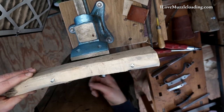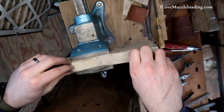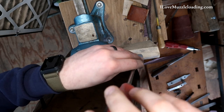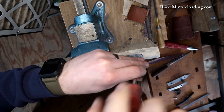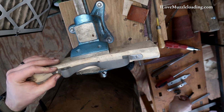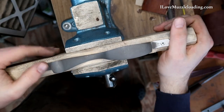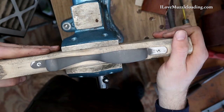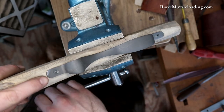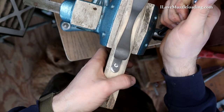I'm just chucking this up in the vise. We're going to attach our trigger guard to it, and that's going to make it a lot easier to work on at least the exterior of this guard. Working on the interior gets a little tricky. I'm going to line this up with one of the holes I already have and screw this down. These are just some cheap hardware store screws — just users. From here you can see we can pivot this as much as we need to get into the nooks and crannies. It makes it really nice and easy to work on your trigger guard.